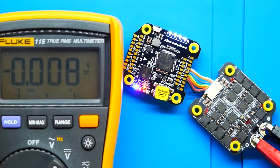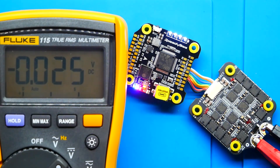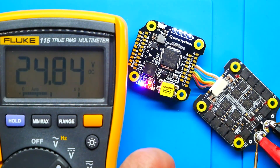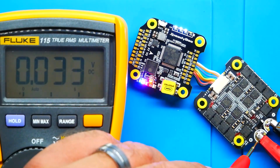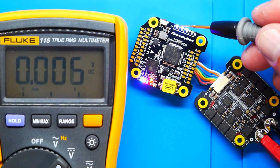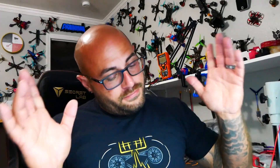I'm putting my multimeter into DC voltage to test this. We're running 24.8 volts, representing a full battery — 25.2 would be full full, but we're pretty much there. I'm going to drop the voltage — now I'm at 24.1 volts. Let's take a peek: 24.18 volts, so we're not at a full battery anymore. And what does our LED bar tell us? It tells us we have three bars. It's simple but absolutely genius — a sensor that gives you a quick visual battery status right on the flight controller.